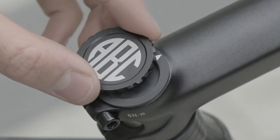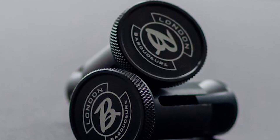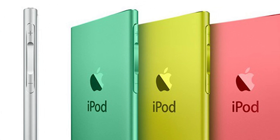The fun part is choosing materials. Here's my quick guide of my favourite materials for CNC machining. Number one: sandblasted anodised aluminium. It sounds like a mouthful but the CNC supplier will know exactly what you're asking for. It's super affordable, easy to machine, lightweight, strong, and durable — it's pretty much got everything going for it. The only thing it doesn't have is that nice weight to make something feel expensive. That said, it's used on loads of amazing products — the old iPod used to use it — and I'd recommend trying it out.